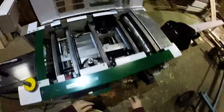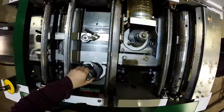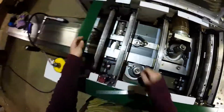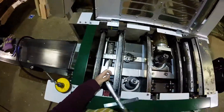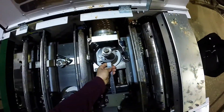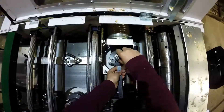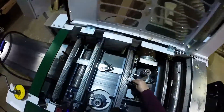I had to move back the first fence to access the bottom cutter, which is why I'm having to set the fence again. I'm now setting the distance between the second spindle and the second fence — setting it here to 150mm, which is the starting size of the boards I'll be putting through.